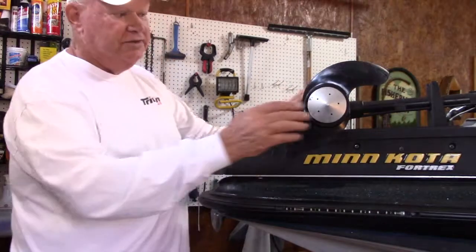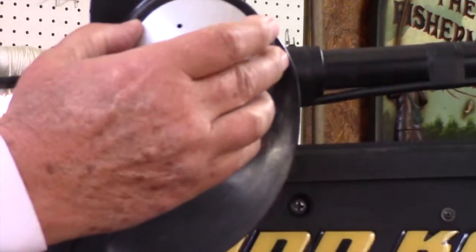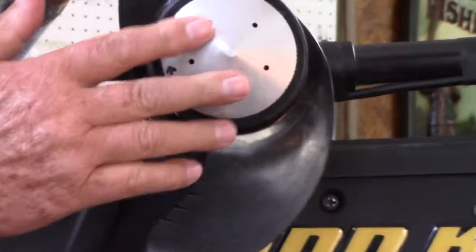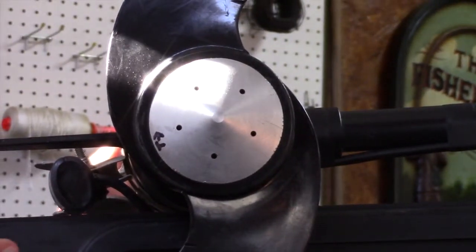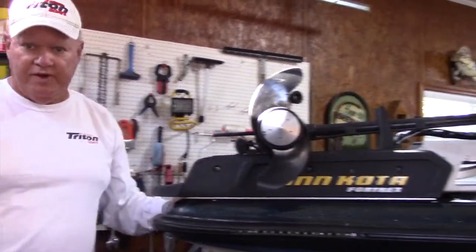The other thing, this is something I just bought this past year, but it works great. It's a little lug nut, for lack of better words, that you take an old nut off there and secure this by just tightening it on here. What this does, it takes anywhere from 20 to 30% of the vibration out of your trolling motor, and it also cuts through the grass a lot better when you get up shallow. That's a very nice addition. It runs about $35 to $40.